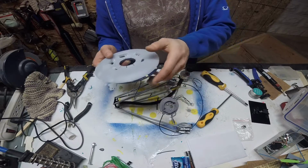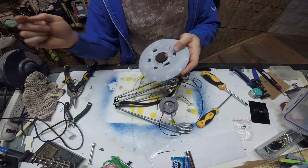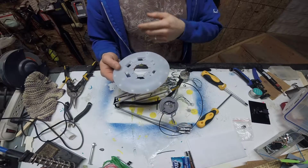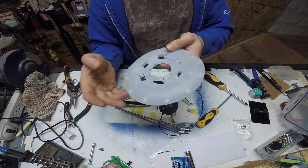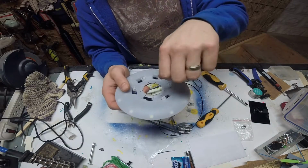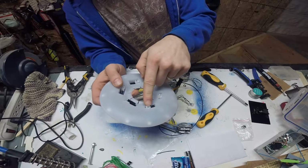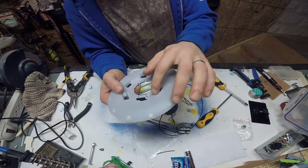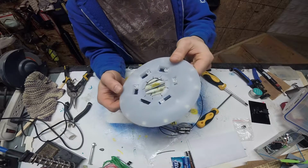They're put in such a way that they're hard to take out, and I ripped off 3 of the 6 contacts after, I don't know, second time taking it apart. Now, something else I noticed, I straighten them out now, but these white headers here, they're quite tight. When I'm trying to remove these, the plastic is actually coming with it, and I noticed they were bending, which after doing that a few times, one of these is going to pop off. I'm going to have to solder this or get a new board. That's eventually what's going to happen here.